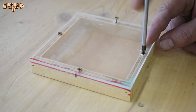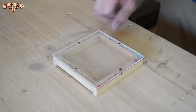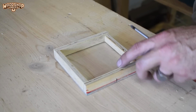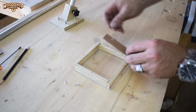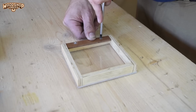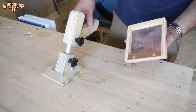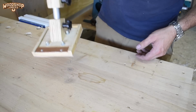To increase efficiency, adding and removing the container needs to be fairly effortless, because this is going to be done quite often while using the tool. That's why I'm going with a type of hook latch mechanism. But the hook latch mechanism alone won't be enough to properly secure the container to the tool. That's why I need to add some sort of locking mechanism as well.